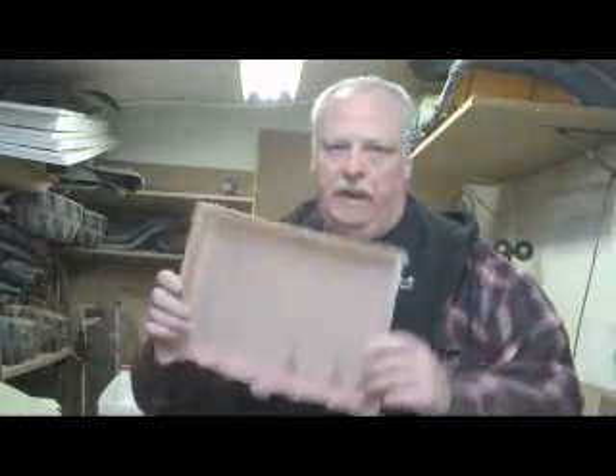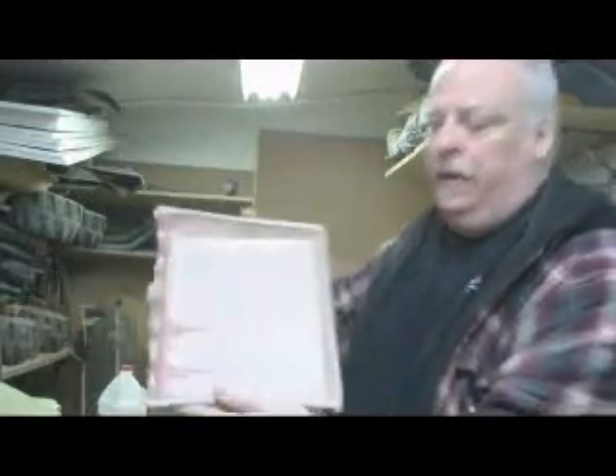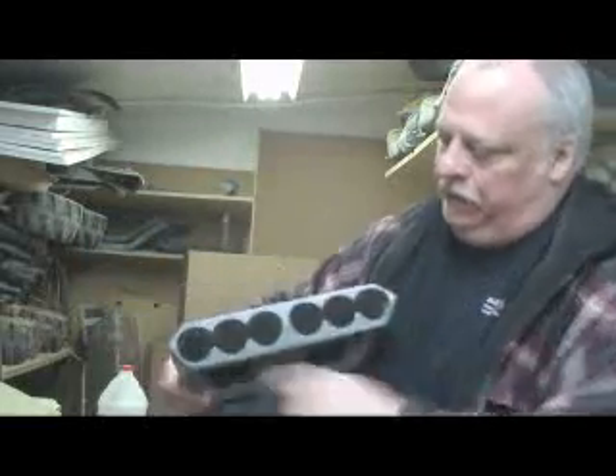This is the mold that I made. I made this just of a piece of wood, putty, cloth, a couple pieces of pipe, and I made the mold. I made two castings and I put the two casting halves together. You can see the two halves here put together, fiberglassed, and you can see where the holes were.